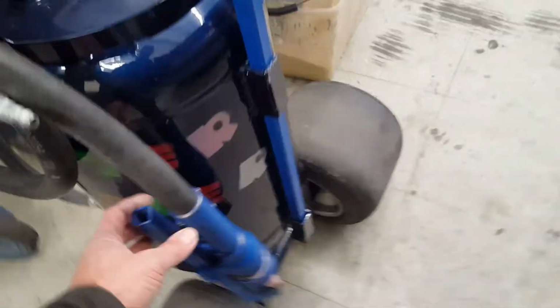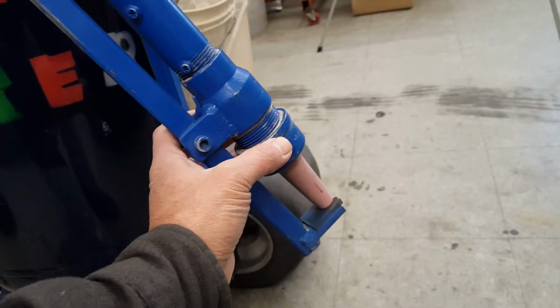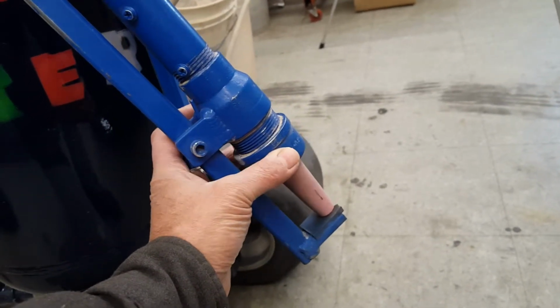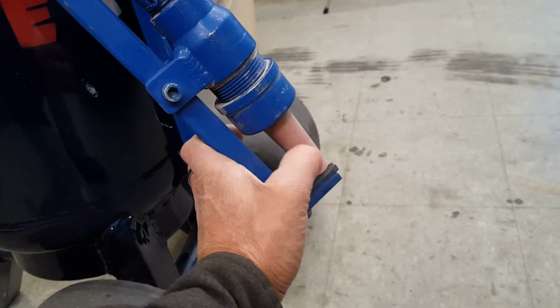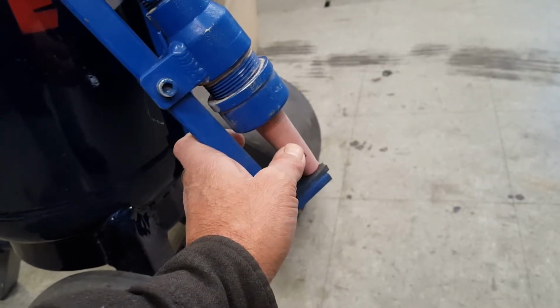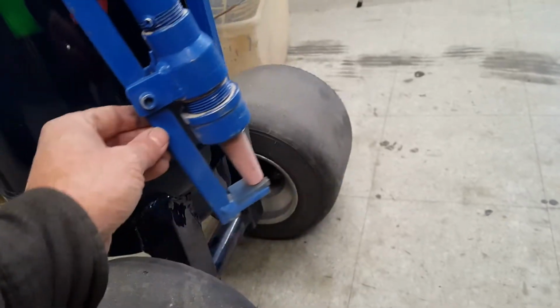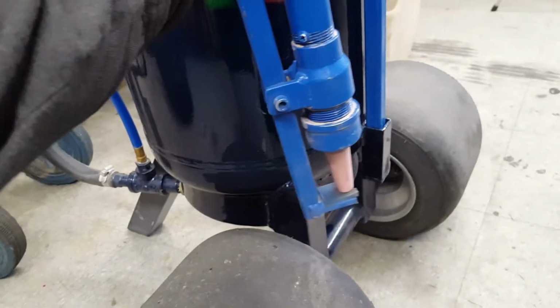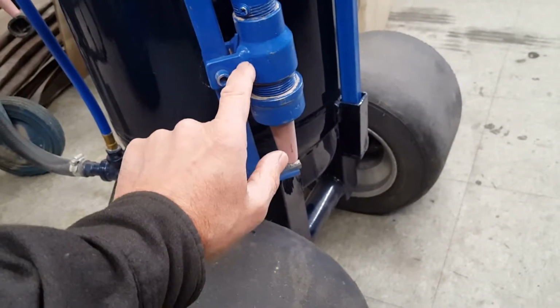The Dead Man, I had made from scratch. Okay? Basically, it's 1.5 inch black iron cap, drilled and chamfered with a hole. This is a real Sandy Jet carbide blasting tip. They're about $30 a piece. I bought a big box of them. Basically, I had a spring from an old clamp, 3/4 inch stock, and basically, you see that? It just absolutely works perfect.